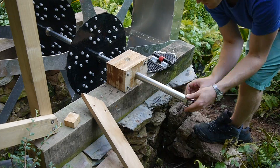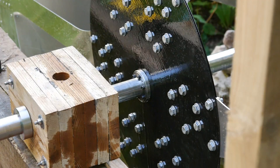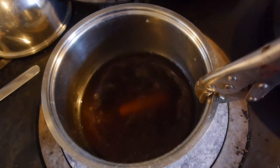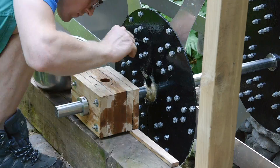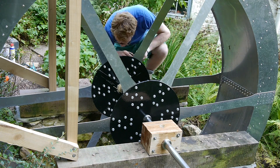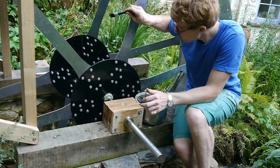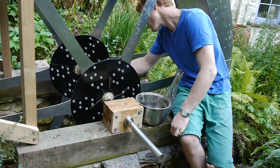The shaft collars are attached so the wheel doesn't move sideways and crash into the wall. The compression hubs are the only component I couldn't get in a corrosion resistant material, so they need protection. As a temporary measure so that I can take it apart if I need to, I decided to cover them in beeswax softened with oil. If anyone knows of an industry solution please let me know in the comments, as I couldn't find one that was long lasting and non-toxic. I may paint them at a later date but then disassembly would be much harder. As for how true the wheel runs — it is fantastic, I am so pleased. By spreading the compression hubs before tightening them down onto the shaft the spokes are tensioned, making the wheel incredibly strong and true running. Laser cut parts are awesome.